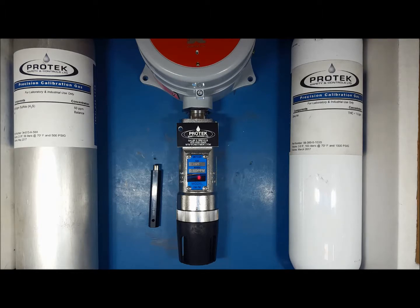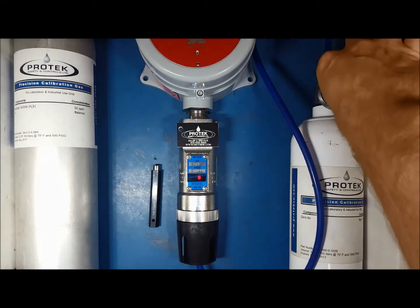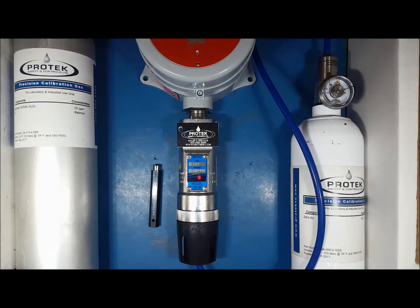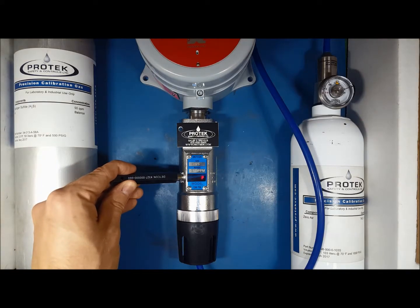If you do not hold your magnet over either PGM1 or PGM2, the calibration menu will go back to the operational display in operational mode after 2 cycles of the calibration menu. While in operational mode, apply the zero gas to the sensor element. Hold the magnet over PGM1 to bring up the calibration menu. From there, hold the magnet over PGM1 for another 5 seconds.